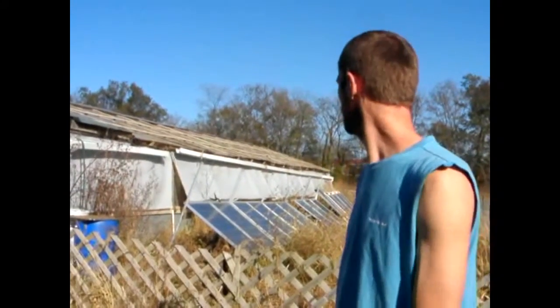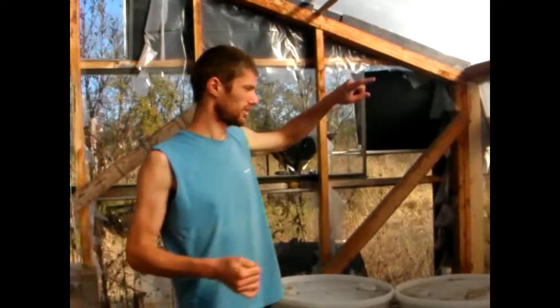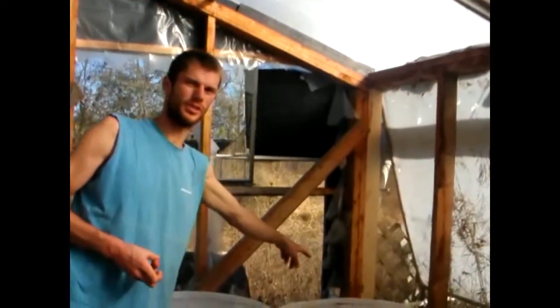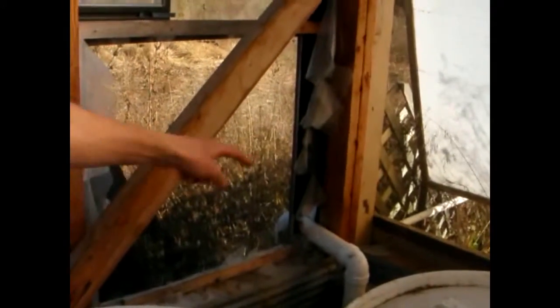Right, so the water comes off the roof, round through this tube here, you can see, through the pipe down there, down to the ground, and from the ground it feeds out of these little black tubes into the barrels. The weight of the water, with it coming from a higher level than the barrels, evens out with gravity, and it fills the barrels up to the top.